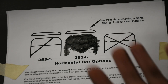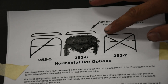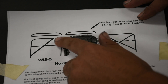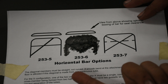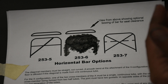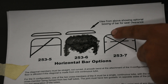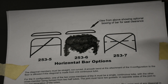The double diagonal adds overall rigidity to the cage, but the main benefit is passenger protection in a rollover. I'm only doing a single diagonal because I'm not often driving with a passenger, and when I am, I'm not pushing it to the brink of rolling over. My friend Nikita, however, takes on a lot of passengers — his girlfriend drives with him often — so he definitely wants a double diagonal.